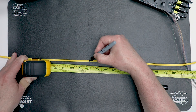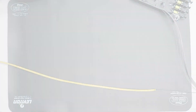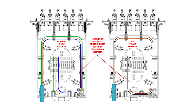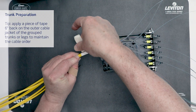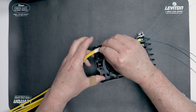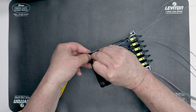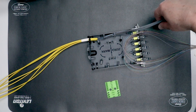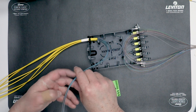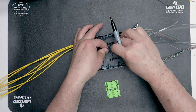It is recommended to remove at least 48 inches of outer cable jacket from the entrance point to the splice module. Ribbonized cables should be routed into the module in the following order: blue represents ribbon one, orange ribbon two, and green ribbon three in the first splice sleeve holder, and so on through the six ribbon groupings in the second splice sleeve holder. Feed incoming cables through the rear opening and secure through the tie wrap slots over the cable jacket with one of the provided nylon cable ties. This tie wrap will be removed after pre-routing and marking of fibers prior to termination. Route the trunk fibers concurrently through the cable entry channel and around the module base clockwise — one loop is recommended. Mark the fibers at the zero mark guide, remove the tie wrap, and remove all fibers from the module.